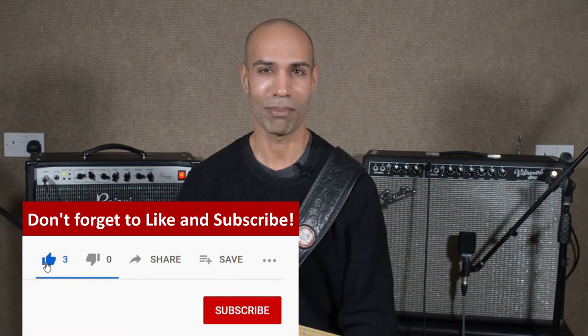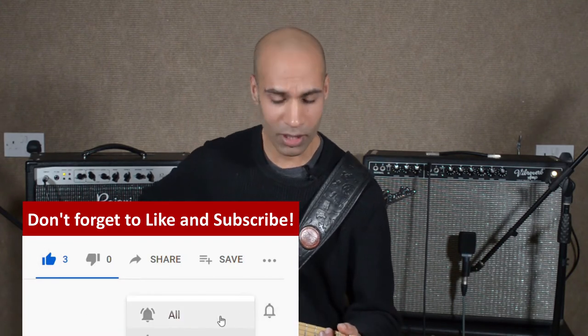So what does this all mean in practice? What it means is that this amp is going to achieve 90% of its volume at around 3 or 4 on the volume control, whereas this amp is going to achieve 90% of its volume at 90% of rotation of the control. So it's a massive difference. People often criticize these linear-type volume controls for being really hard to use, and in particular it's really hard to dial in a bedroom level.